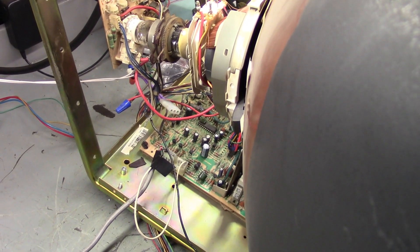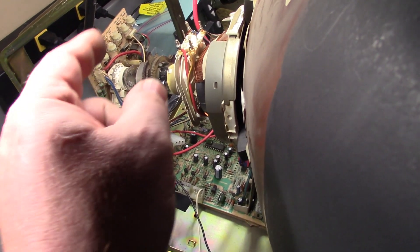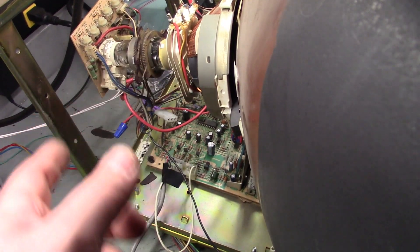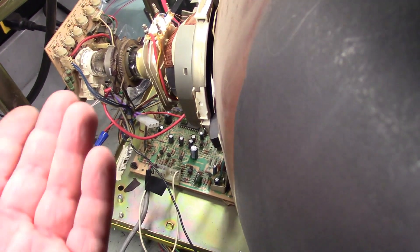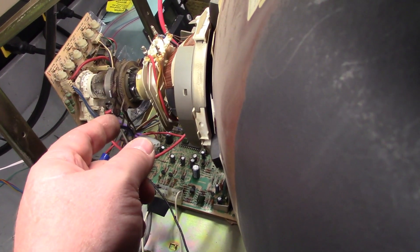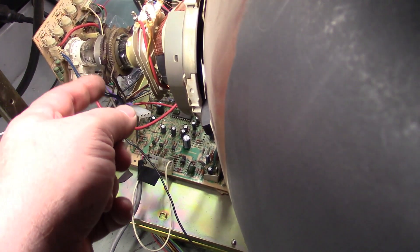Because it's not that scary and it's not difficult to do. If you ever have to do a tube swap that involves replacing the yoke — the rings have to come off to change the yoke — it's all about finding the right position. You want to keep the original rings with the original tube ideally, because if you take the yoke off and damage the rings you're going to have to replace the entire ring set from another tube. So ideally keep the same rings on the same tube forever — but that's not always the case. Sometimes you get some that are busted and have to replace the ring set.